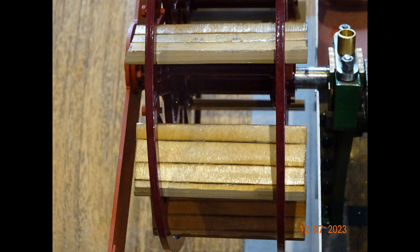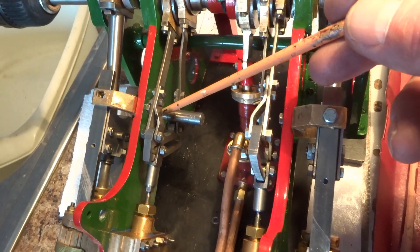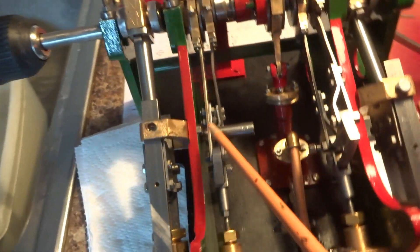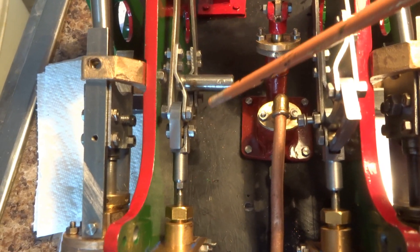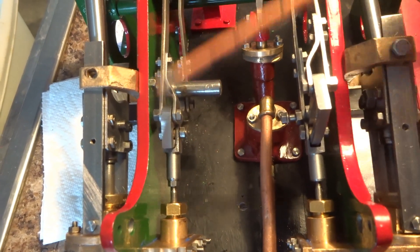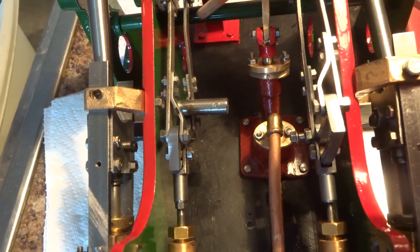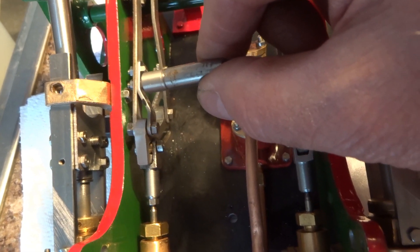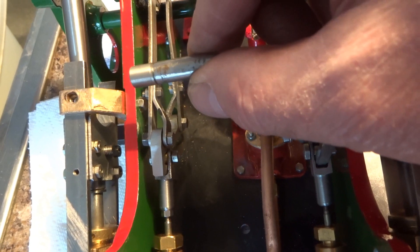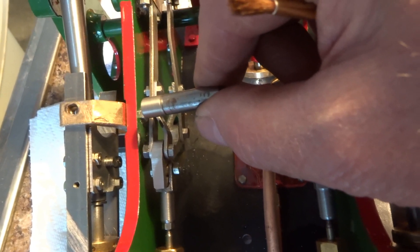An example of the planking attached to the paddles. This is an example of where the homemade nut runner comes in handy. There's a couple of 5BA studs here and I can't get my fat fingers in. It was convenient to erect the link motion first and I can't get my fingers in to do these studs up. So my homemade nut runner is the bee's knees — just putting them in the holes and tightening them up. They don't have to be enormously strong, just enough to be fit for purpose.